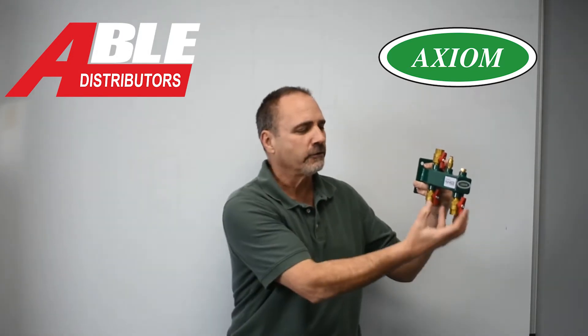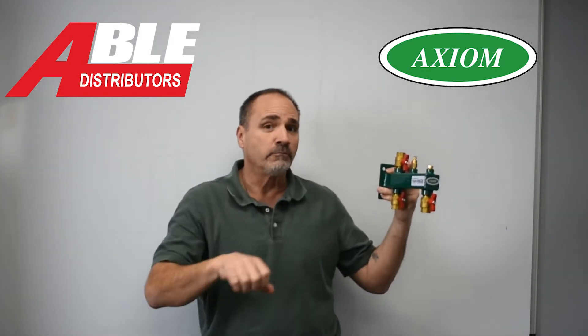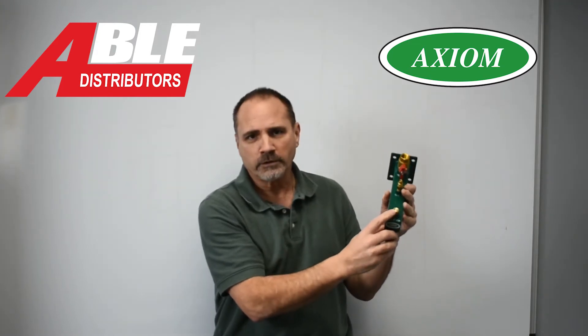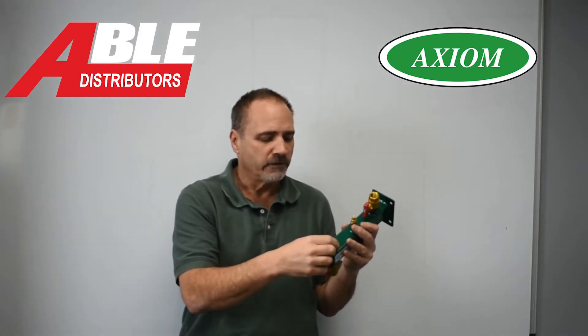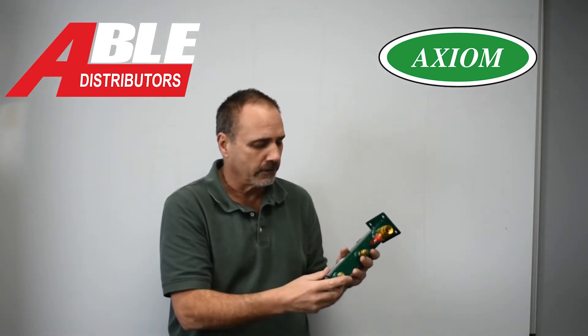Because if you've got your boiler solid and you've got this solid, now your expansion tank is hung solid. You can pipe from here to your boiler solid, your water in — so everything's isolated. It does have one more quarter-inch port that if you wanted to add another temperature-pressure gauge, you can. You can leave it just that way, or if you wanted to put a different type of vent — an auto vent or something like that — you could add something like that in there.